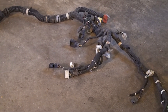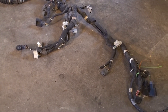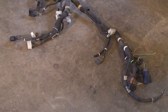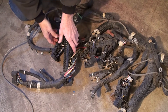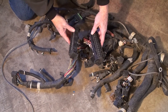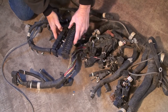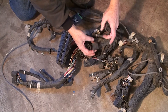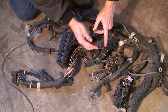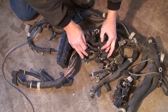Multiple types of couplers are used. All the wiring is color-coded and each harness coupler is tagged with a code that identifies it. Study the harness on the floor and you can see the amount of engineering that went into the design. Starting at the fuse blocks, you'll also see plenty of connectors associated with relays, which would likely be mounted on one side of or to the back of the operator seat.